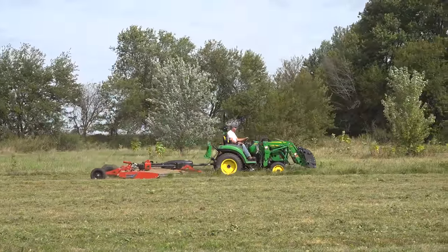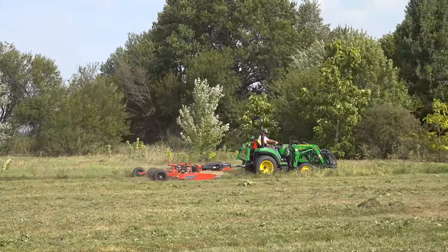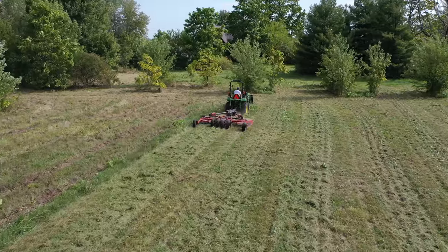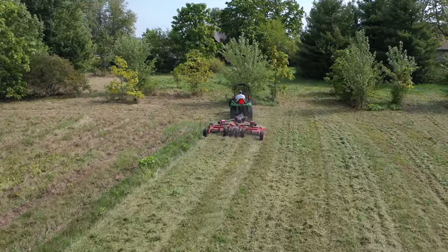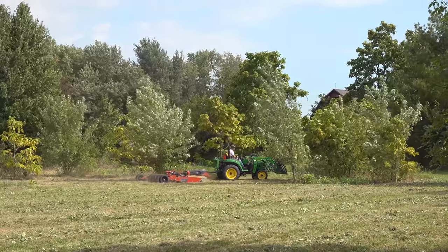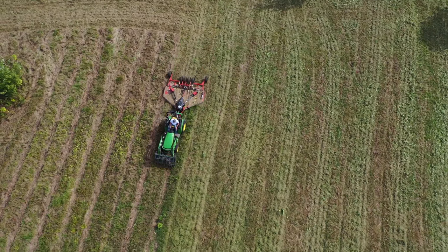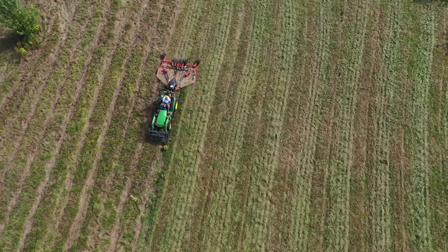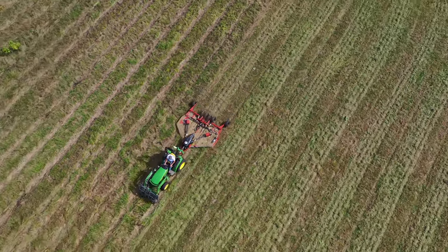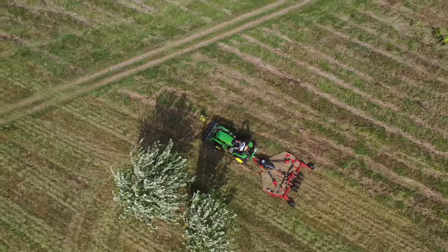It's a little hard to tell here because there are quite a few little trees or saplings that have grown up in this grass. While the grass was cut a while back, what it did is produce a lot of what we'll call matted paths, which sometimes for a regular finishing mower you realistically have a pretty hard time getting through — it's just too much bulk. If you're still with us at this point, you might be interested in getting one of these 10-foot mowers for a tractor that at least at first appears too small, like this 2038R. I'll take a few minutes to talk about some of the complexities of making that work and help you decide if you can make a large mower like this work on your small tractor.